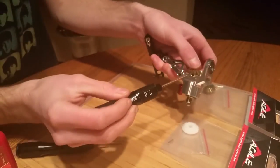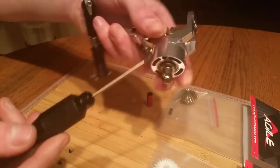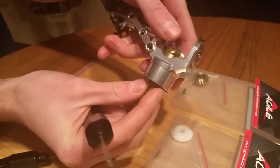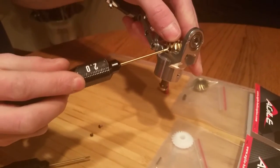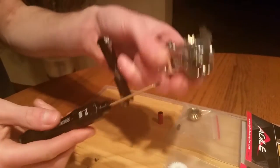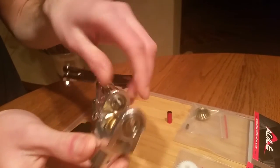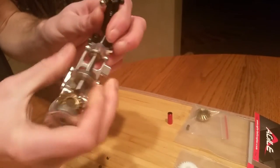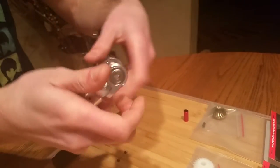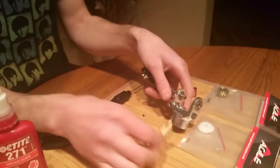Then we're going to take our 2mm and loosen up the two screws and pull those off. You're going to want to take those completely out so it doesn't dent the case around the edges. We're going to remove these two set screws from the gold crown gear, then pull this crown gear off — you won't be using this at all, so put that to the side. And then we're going to have this, which is the shaft.